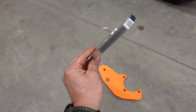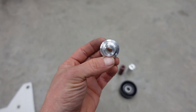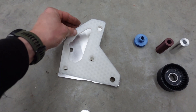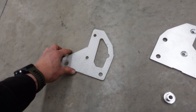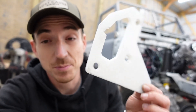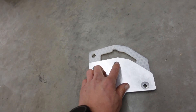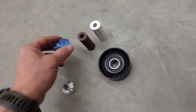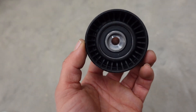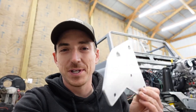There is the final piece we need to get our front drive all sorted out. That looks pretty freaking schnazzy. We got our back plate made up. We went ahead and ditched the hole that was in the 3D printed part — that hole was there to shorten up the print time, and this guy only took like five hours to print. We got our holes countersunk on both sides, and we added one in the correct spot. We also made up our spacer, which slides right into the pulley and is a nice tight fit, and then we have the bracket spacer that we busted out on the lathe.